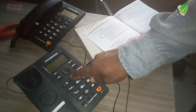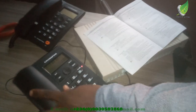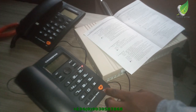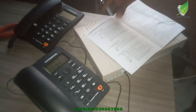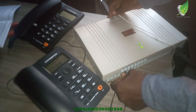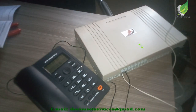The first number in the default scheme is 102 with hash, or you can configure it as 104 with hash, or 801 with hash, 802 with hash — depending on the configuration you want. I'm going to keep the configuration that the PBX came with so as not to confuse the staff, since the old PBX used a similar numbering scheme and I don't want to give them something totally different.